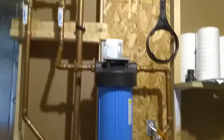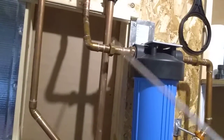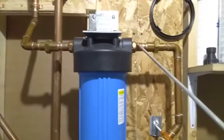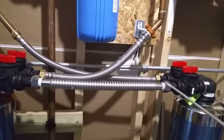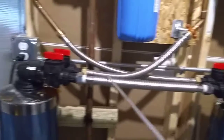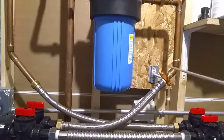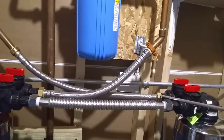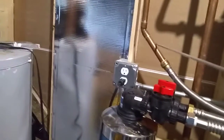As a reminder, what you'll need: a one-inch pipe fitting and a union up at the pre-filter. Then water softener ends and a hose to connect the two tanks together. And to connect into your plumbing on each side, a water softener end, a hose, and a shark bite into your plumbing.